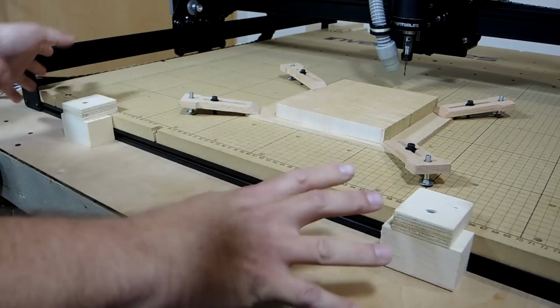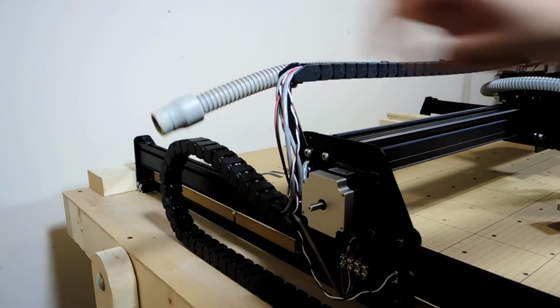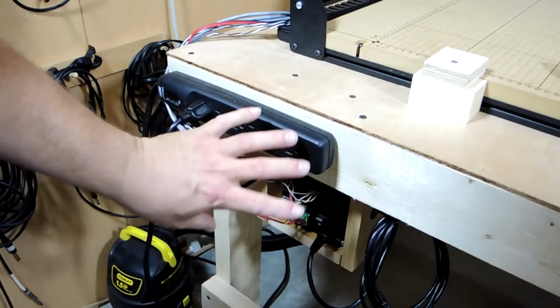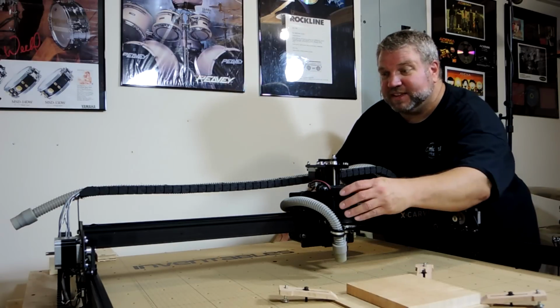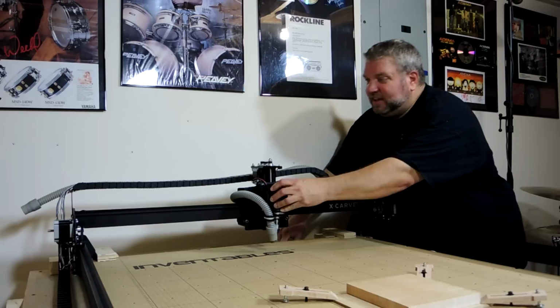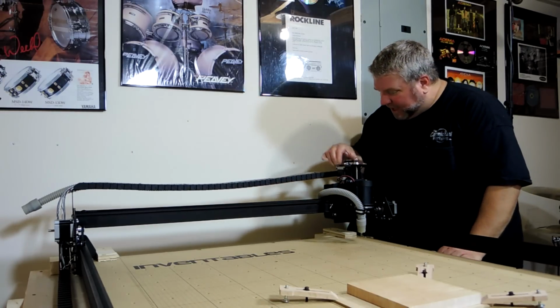So since it's all secured, let's fold it up. I need to disconnect the vacuum hose, and I need to unplug the vacuum, but I can leave all of this attached. And one important thing that I definitely don't want to forget is to slide the whole gantry back so it doesn't crash, and slide this assembly over to one side so it's supported by one of the blocks